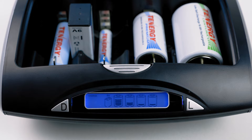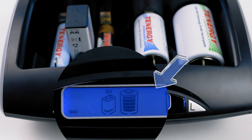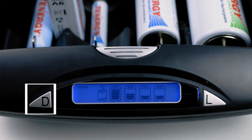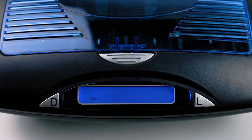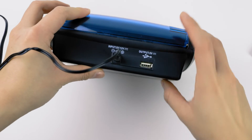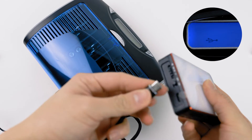For the LCD screen, it will let you know when the battery is charging or discharging, or when it detects a bad battery, such as a defective one or a non-rechargeable one. The D button on the left side stands for the discharge feature, which can discharge batteries at a rate of 400mA. The L button on the right side stands for light, to turn on the backlight so you can see better when it's darker. As an extra feature, there is a 5V USB port on the back of the charger to recharge your other electronic devices. This function is only available when there is no battery in the charger, when charging is complete, or during discharging. The USB function icon will appear to let you know when you can use it.